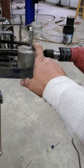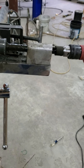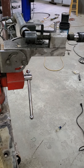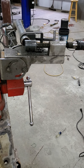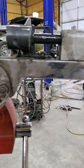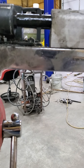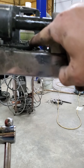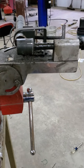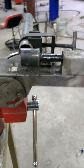I went to a bearing block from Summit — I forget how much it was — and it's a replacement for the joint jigger, the original one that this notcher is kind of a copy of. That definitely straightened everything back up and it was a direct bolt-on. I did re-shim, which is pretty common on these to get that back on the center line again. You shim with a washer between your clamp and your frame — it's usually going to be low.